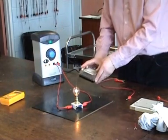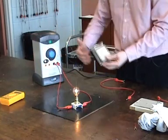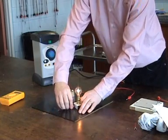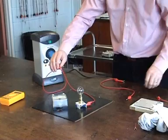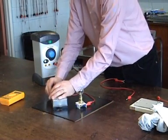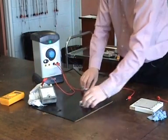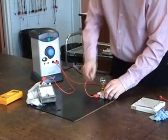The analog ammeter is basically like figuring out how much water is flowing in a stream by making all the water go through that machine, then letting all the water out the far side. So if you're using an ammeter, it has got to be in series — as part of the circuit. These connectors are called spade tags. So I put it here and complete the circuit like so.